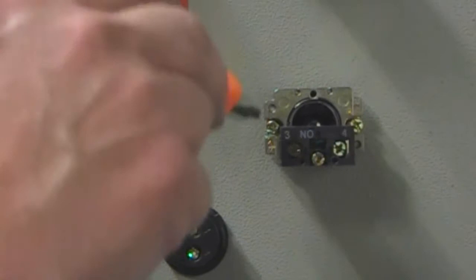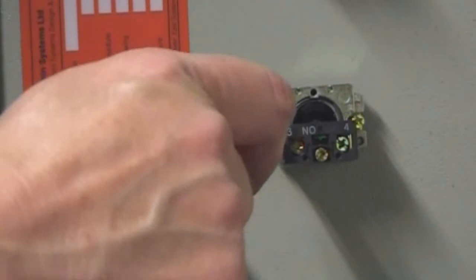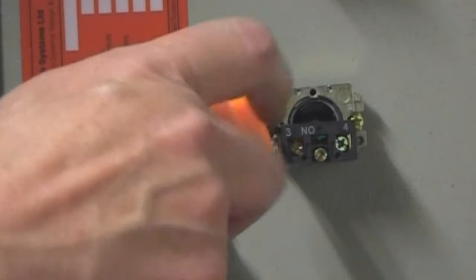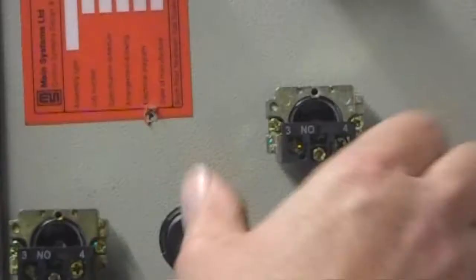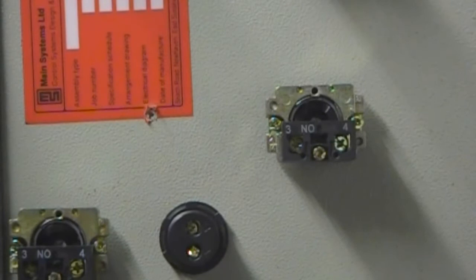And they just need tightening up equally. You can see the back plate and just keep that level by eye. Just do each one up in turn till they grip. You don't have to over tighten them and risk breaking the cast collar. Grip and they'll do enough. Make sure the switch operates, no bits and burrs in there. And that's it. Zoom you back out.